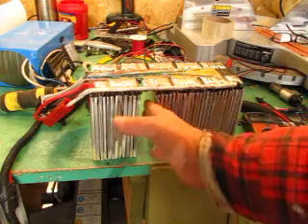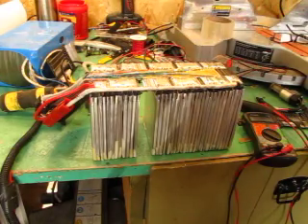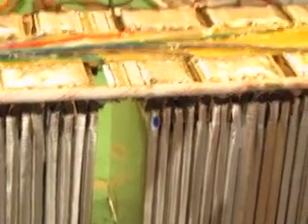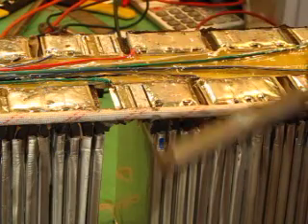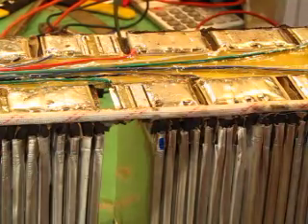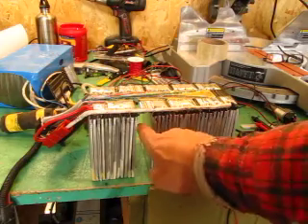In the last video, these cells were here. There were four cells and I've taken them out. I've unsoldered them — the tabs at the top. The tabs go through little slots in a small fiberglass PCB. What I did is I used a high-wattage soldering iron and a chisel, heated the connection, let the solder fall, then pried underneath the tab gently and lifted it up until I could pull the cells out.